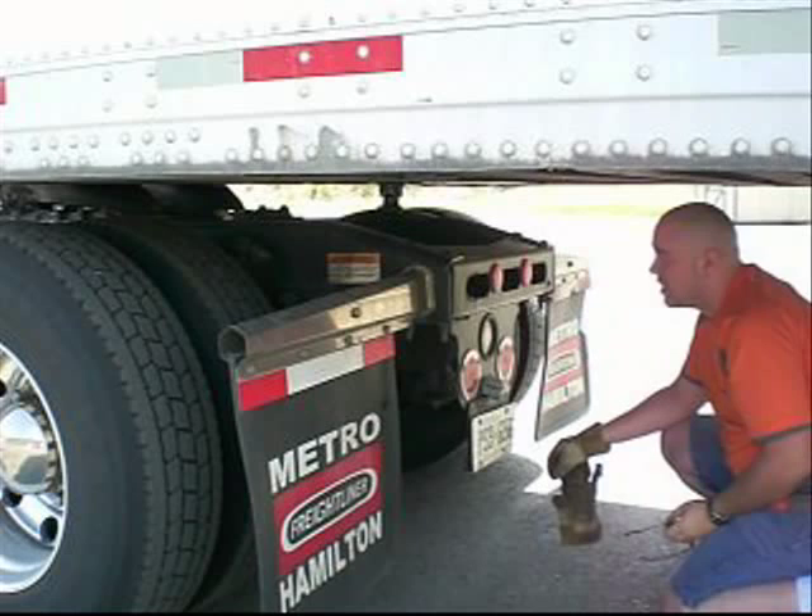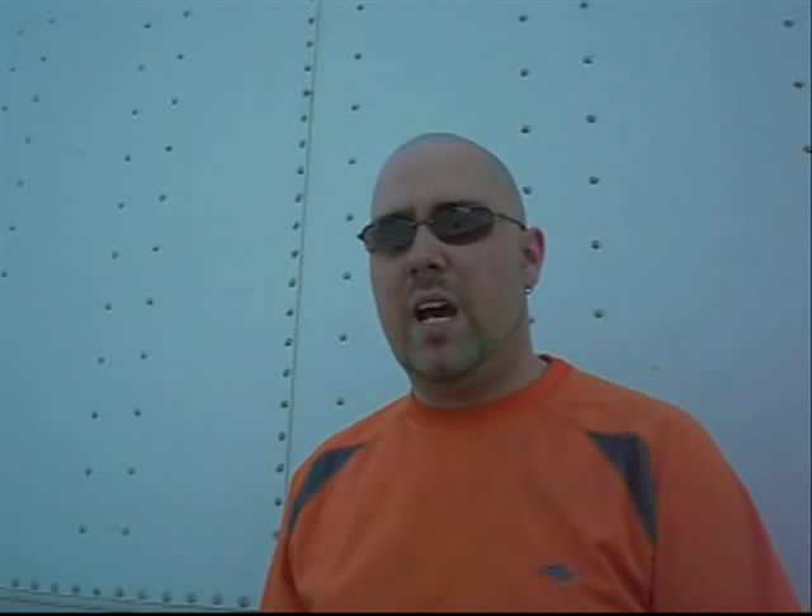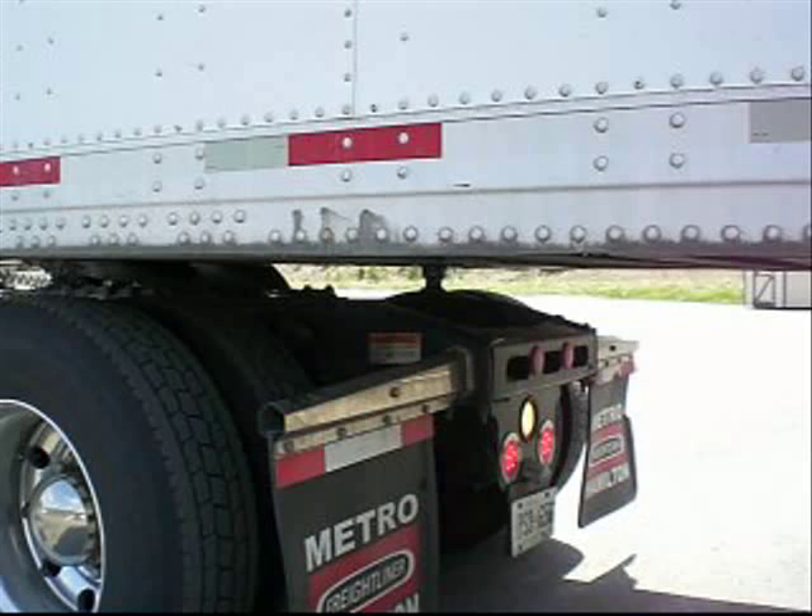It's also a good time to take a look at the lockjaw — make sure it's actually unlocked and you're not going to have a problem. Also look for any debris on the strike plate around the kingpin, anything that can snag it. Now that you've lined the truck up, go inside and start coupling. Back up really slowly until you hear the lockjaw lock.